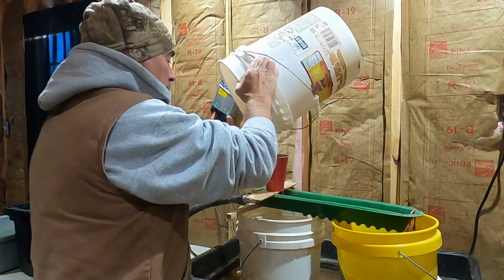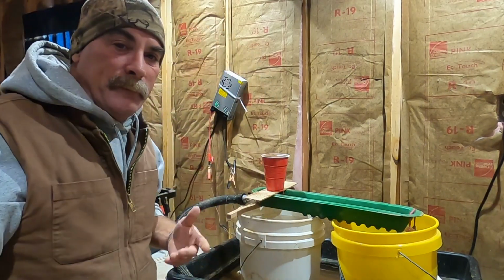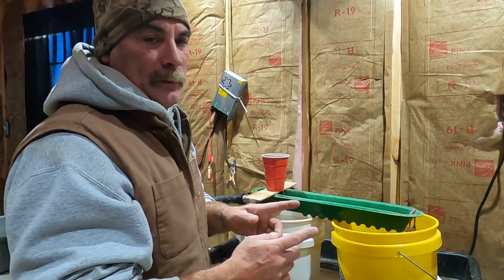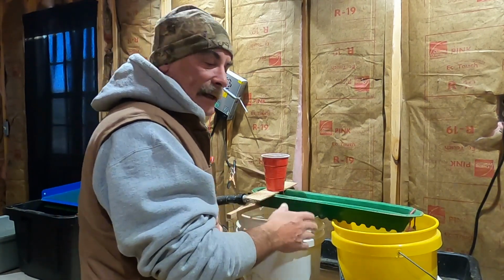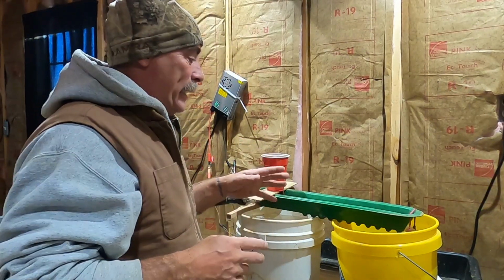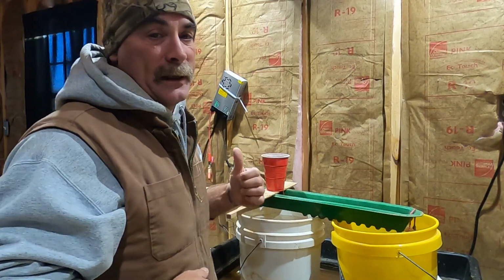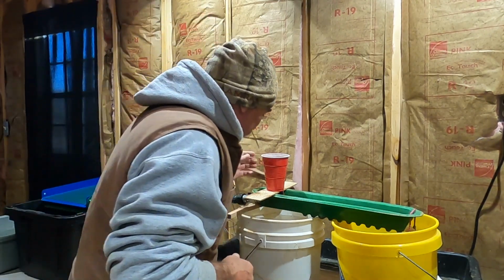There we go. Now, more or less what it does, it's sitting there and it's like an automatic feeder. Now we can do this when it's dry. When it's wet, we actually have to use a spoon to put it in there and clean it out. But what it's doing is it's giving about 3 inches of room for that black sand and the gold to drop in the first, second, third, fourth riffles. That's where we kind of like it. Sometimes you'll see it at the end, but using this is our second stage before we actually clean it out. And then, like I said, we're gonna do the third stage here in a minute, which is classification. And then our fourth stage is going to be our Miller table. So hang in there. We're going to do it. We're going to be right back.